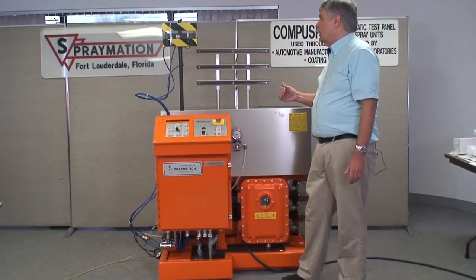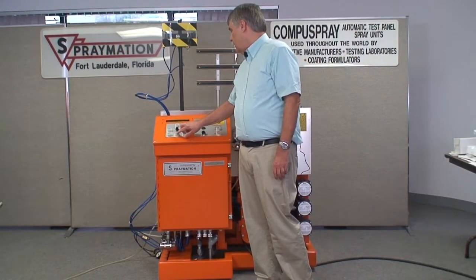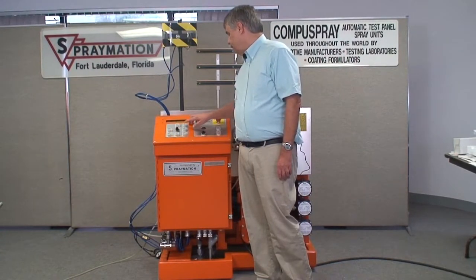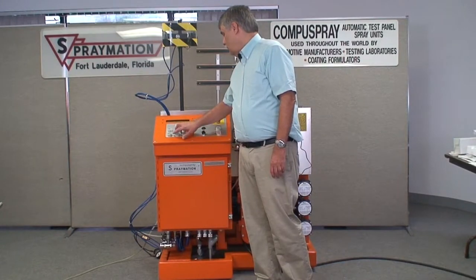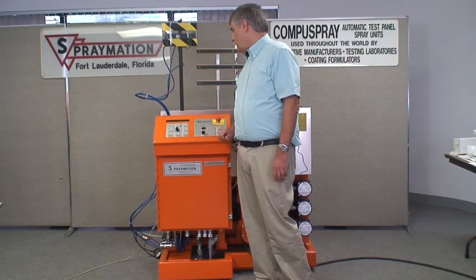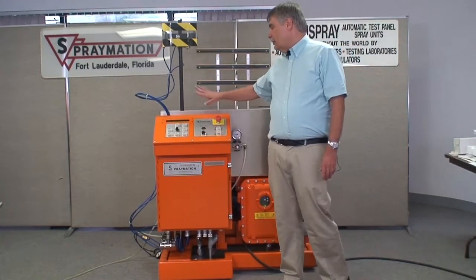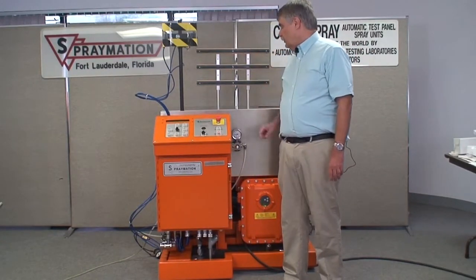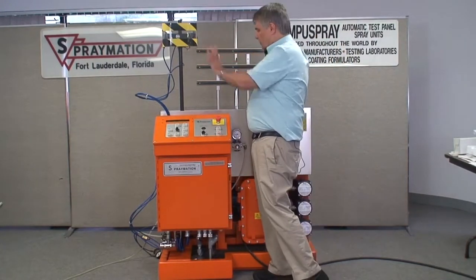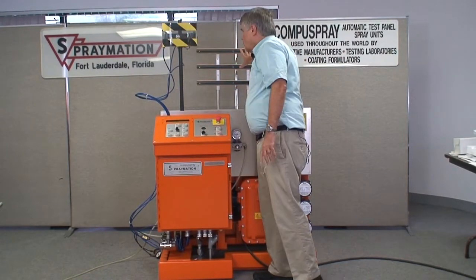So if we wanted to do a quick gun test, we'd use the menu, go down, select the test functions, and say yes. We'd go down again into a second menu, select spray guns, and say yes again. The screen reminds us that emergency stop is pressed in, and all we have to do is press start to get the spray gun to run. So if we're going to do anything, we should have emergency stop in — we can touch the gun mounting bar, the spray gun, or do something to the panels.